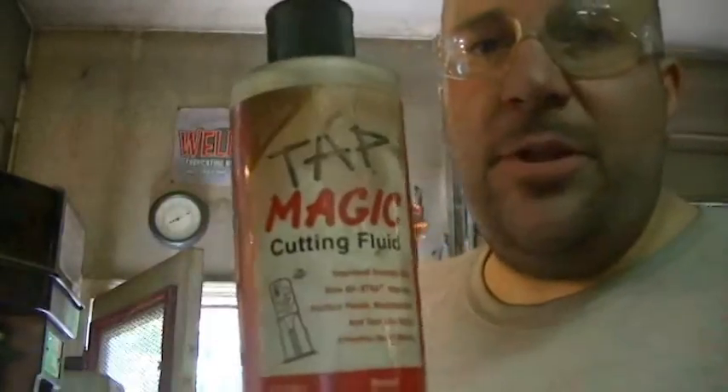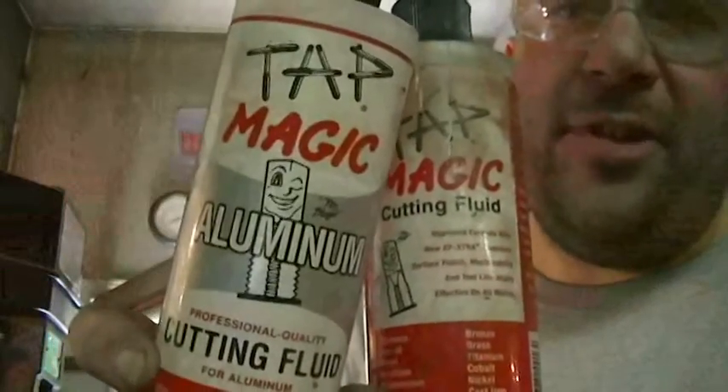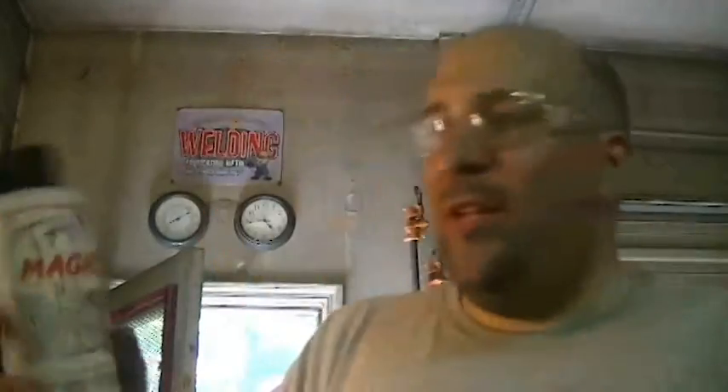Have you ever had one of those moments where you've wanted to pull your hair out? I'm running the piece through the milling machine and because it's aluminum, I don't have the speeds quite right and it's gumming up a little bit. I kept thinking I wish I could lubricate this somehow. If you use regular cutting fluid or cutting oils on aluminum, a chemical reaction can take place and it's not pretty. That's why products like Tap Magic have a companion product specifically for aluminum. I thought I could use Tap Magic for aluminum, but then I remembered — I have this cutting fluid specifically for aluminum that came with the milling machine. Completely forgot I had it. So things are going to go a little bit faster now.